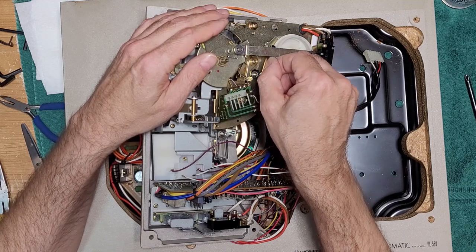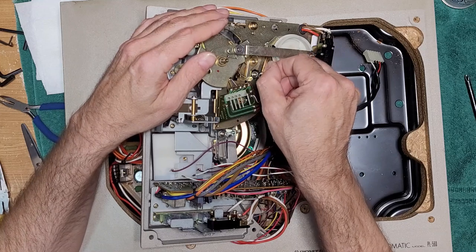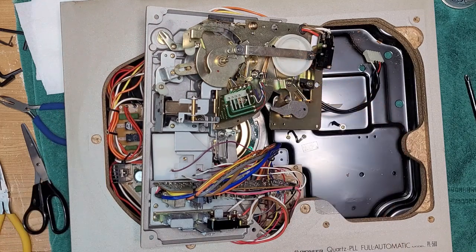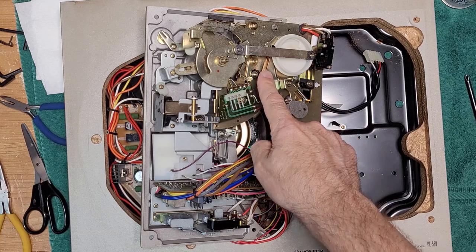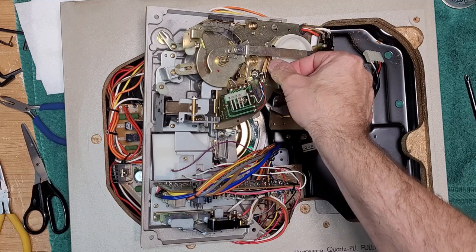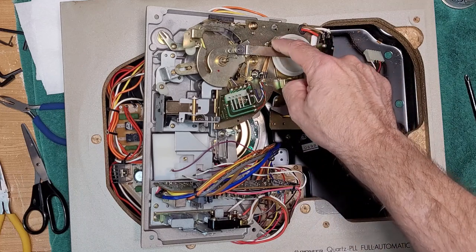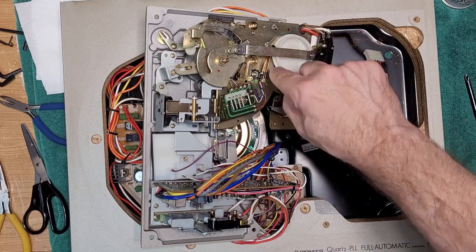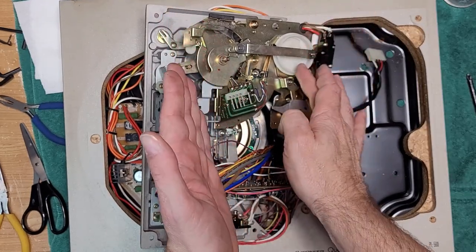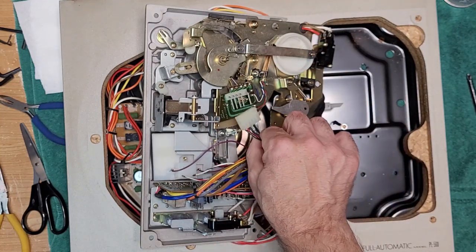And you're going to restore good contact, right? Let's see here. All right. Okay, so that's how you clean muting circuit on a turntable. You usually see a couple copper bars like this where they're just kind of sticking out, and you're wondering what the hell are those. Well, that's your muting circuit, right? And as this turns, it will open them and disconnect the audio cables, and then when it drops back on the table, they'll close again and we'll get signal through it. And here's the connector, which just goes right there.